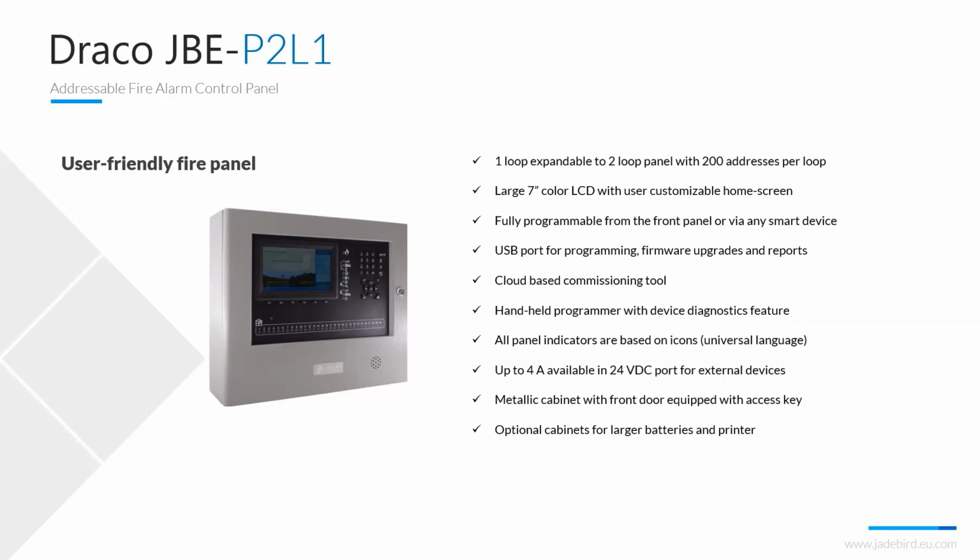It has two independent voltage-free relays, one for failure and one for alarm. It also has a USB port to be able to update the system, load languages, save historical events, and save and load schedules made with the config programming software tool.